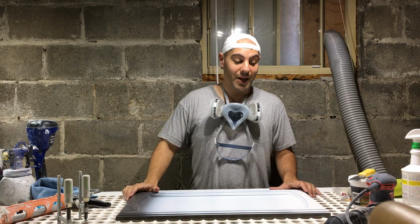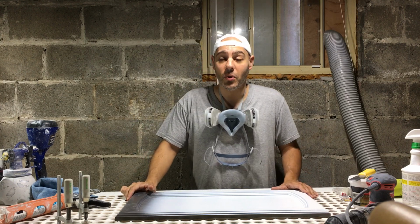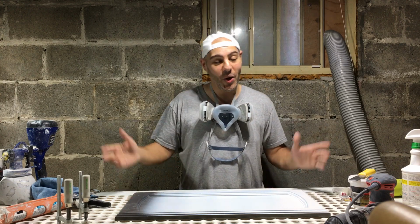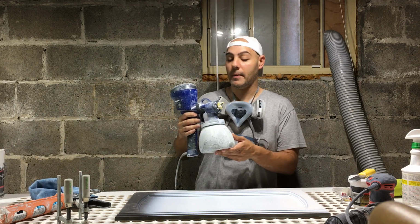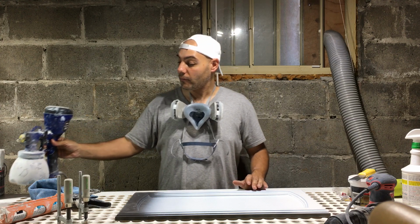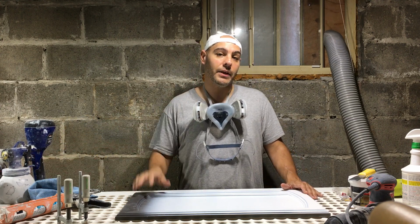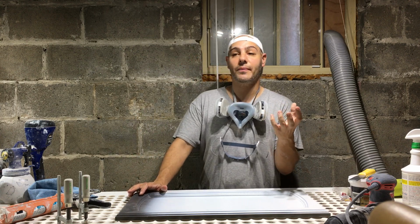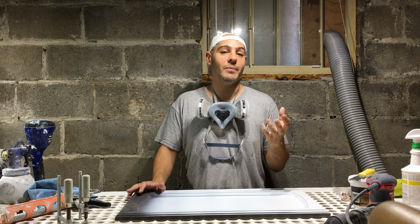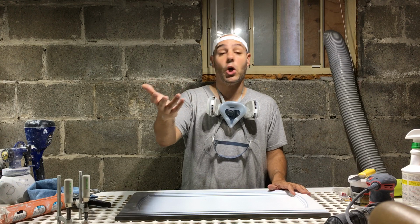But another question is, hey Tino, do you spray my doors or do you slap it on with a big old brush? No, I most certainly don't slap it on with a big old brush. I use HVLP. We spray HVLP in my shop, in my spray booth. And that ensures me that really gorgeous, smooth, glass-like finish. So if you know what orange peel is, if you look at the peel of an orange or a lemon or a grapefruit, it's the painter's worst nightmare, whether it be a kitchen cabinet refinisher like myself or a car painter.